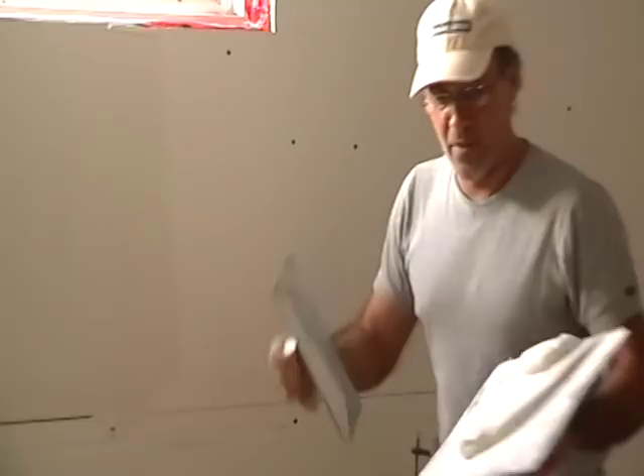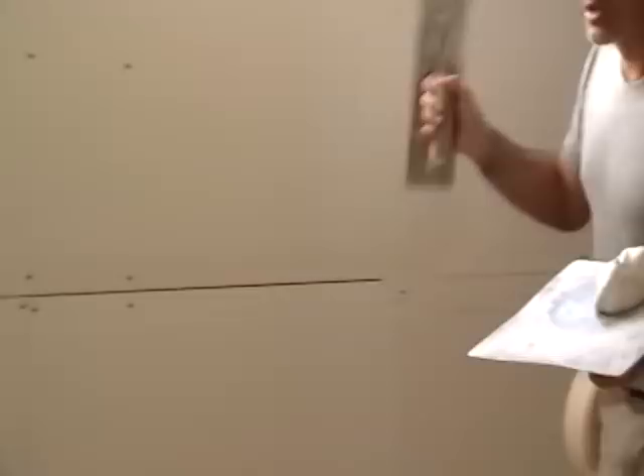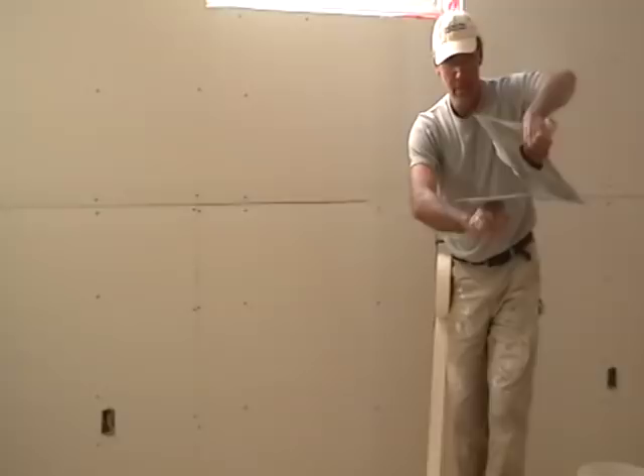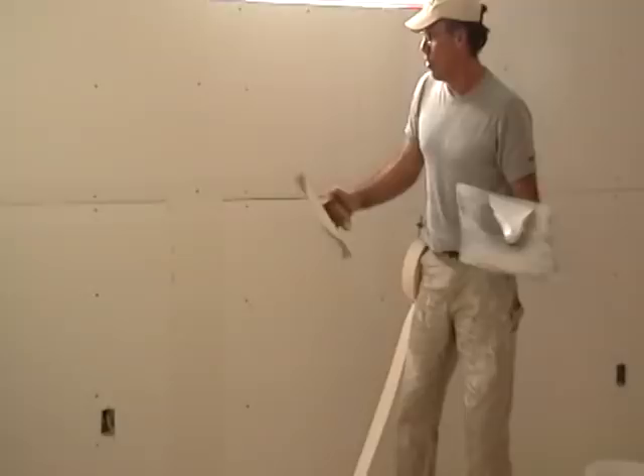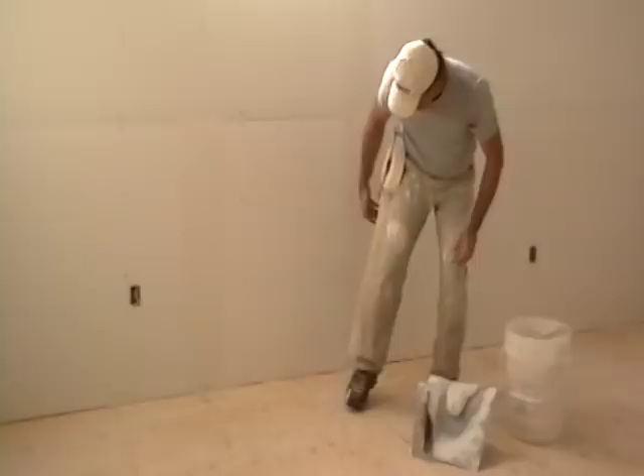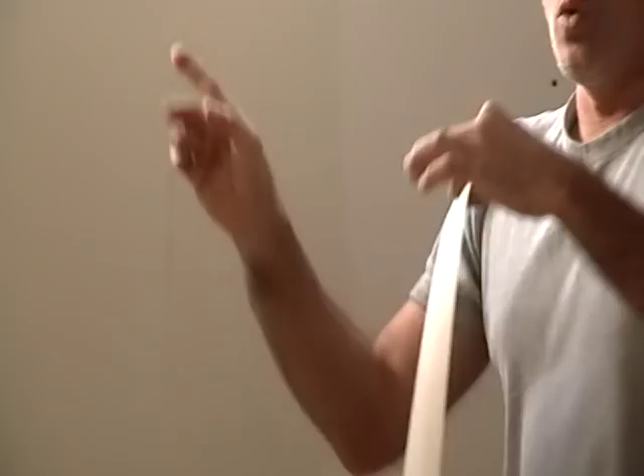That's loaded up. What I did was lay my trowel flat to leave the mud there. Now we're going to go to that bottom butt joint and set it up at the same time so that we can wipe them both together. I let my trowel come around — that's a back hand, just in the middle of it. I'll come inside the floor and my mud's all loaded up there in one shot. Because I've been practicing, I can do it in one shot. Now we put this down.